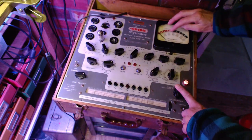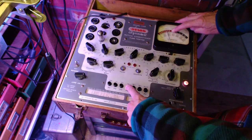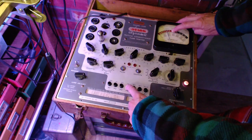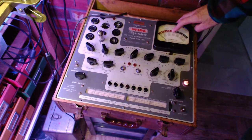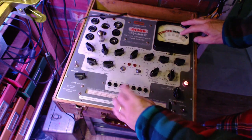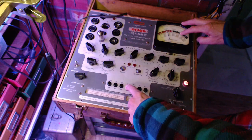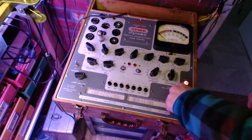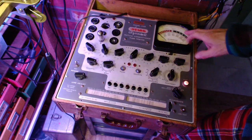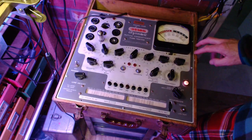On the 3000 scale, 1320 is about there. Gotta get up past there. It's a little weak because my finger's on the reject point. A good tube, an EF89 in good shape, should show 2000, should be up here. Doesn't make it to the reject point. Try it on the English. So you set this to English and then you just read the good and the bad. This is quite a weak tube according to this tube test.